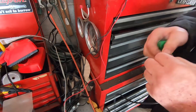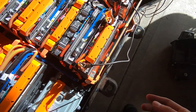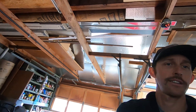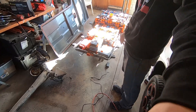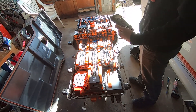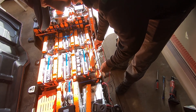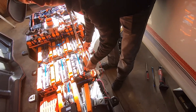We cut the end off the scooter charger, leaving two wires at 24 volts. We took the clips off an old battery charger and spliced them into our 24-volt charger — it needs electrical tape, but that's the setup. That was uneventful; in theory there's 24 volts going in at 1.5 amps. Checking the module voltage: it was 0.4 before, now it's reading 0.8, 0.9 — it's coming up. It's around 1 volt now — it's going up.